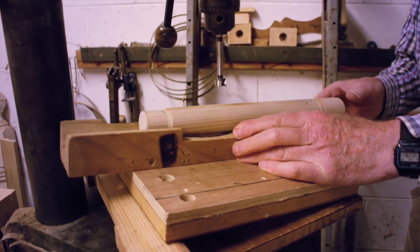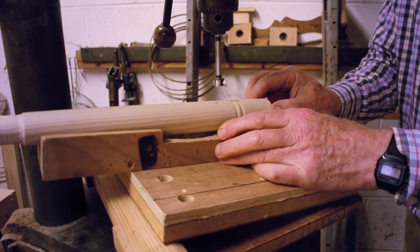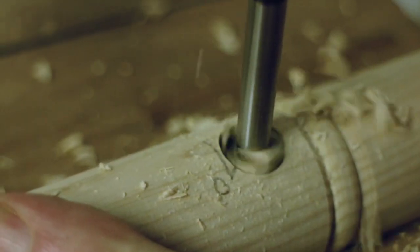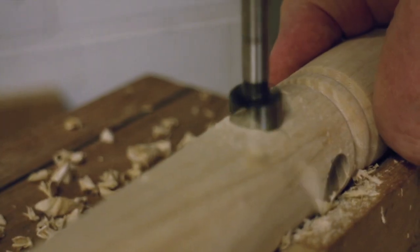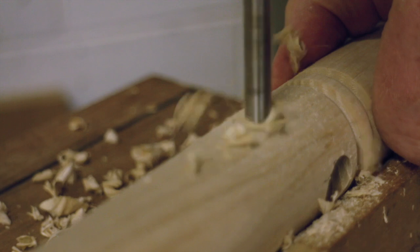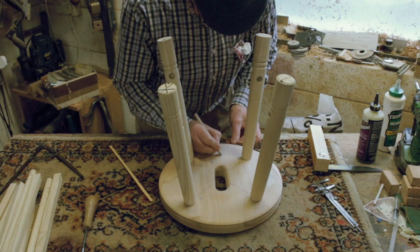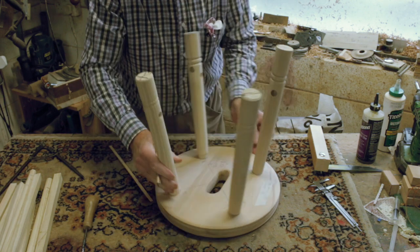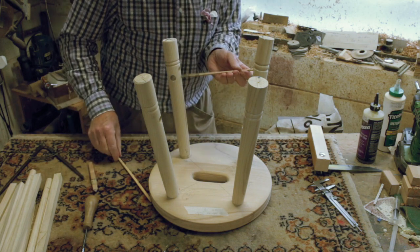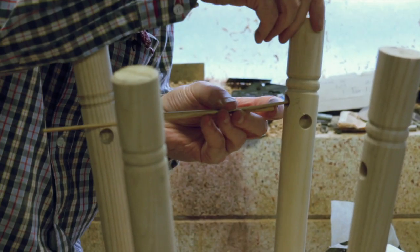The legs are placed on the cradle and drilled with a 5/8 inch Forstner bit to a depth of approximately half the diameter of the leg. It is very important that the stretchers are measured properly as the function of the stretchers is to push the legs apart. I use a piece of 6mm dowel exactly 8 inches long and a strip of a school child's wooden ruler cut along its length.